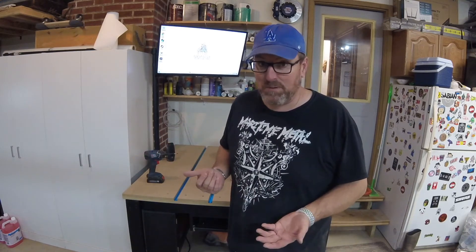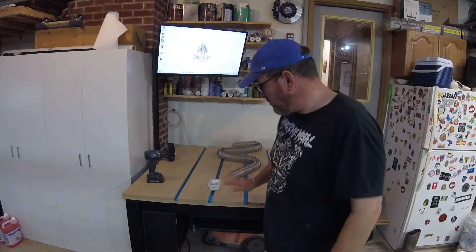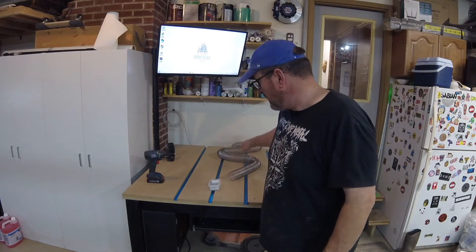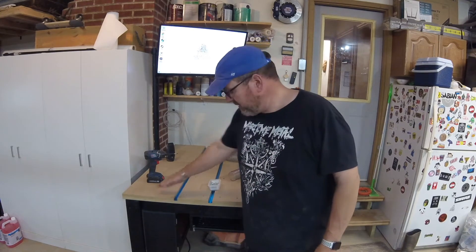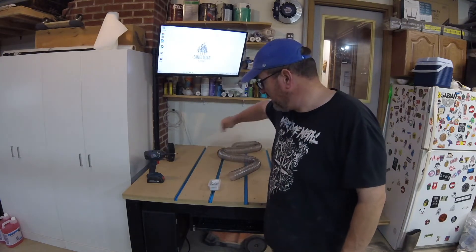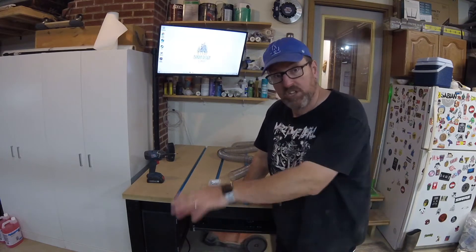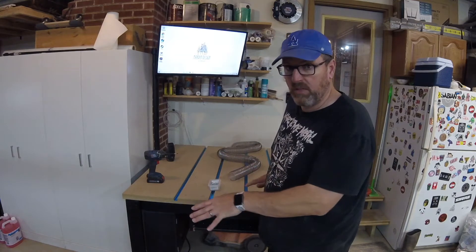The LongMill has a 30-inch by 30-inch working area. I can't imagine I'll be doing many 30x30 pieces — most things will probably be 24 inches and down since I have a 13-inch planer. The T-tracks are mounted and will let me slide clamps in to hold pieces down. In between, I have 7-inch wide MDF pieces running front to back, with 12-13 inch pieces on the ends. The three center spoil boards are designed to take a hit. Once the mill is sitting on the surface, I'll flatten the entire reach area of the mill, chopping down into my MDF by hopefully only a millimeter or so — making it perfectly level to the mill so whatever I put in afterwards will all cut true.